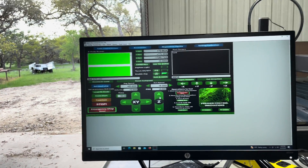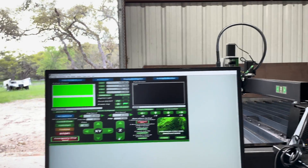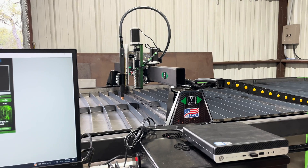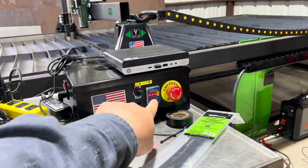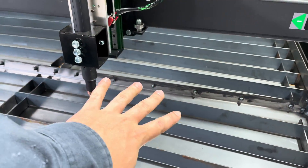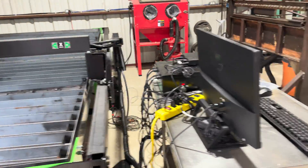I have all my wires just kind of laying everywhere making sure everything works first, so we got everything hooked up into the control box. We're in Mach 3 here — my mouse is going to go up on the Z-axis, which is the torch, and that moves up and down, which is all working really well. We also have XY, which I can use the keyboard keys to control — left, right, forward, backwards. Everything's set up good. We still need to set up the torch height controller, which makes it possible to cut warped metal by clicking when the torch hits something.